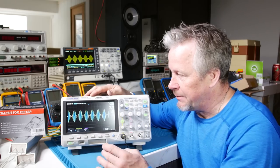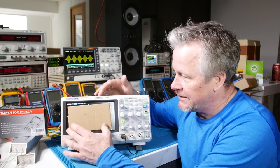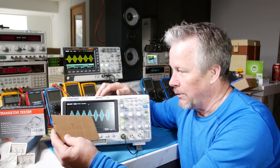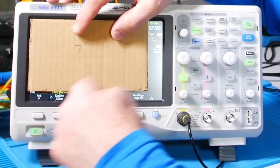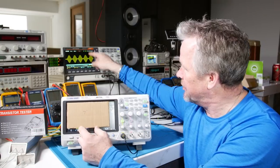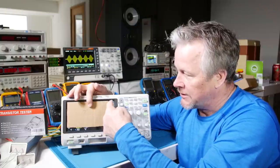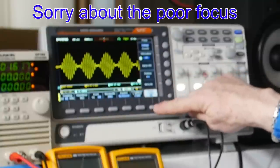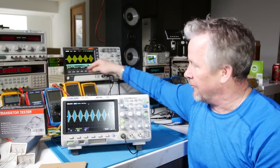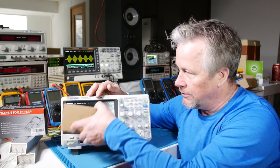About the display — these are 8-inch screens; a lot of scopes have 7-inch screens. Seven inches would seem large if you weren't comparing it to this. The thing that takes away your screen is the borders on each side. If I put a 7-inch area here, that's pretty much what I'd have left after the menu borders. So a GW Instek with a 7-inch screen would actually be as big as this 8-inch screen in terms of usable area, because on the GW Instek I can turn off the menus and reclaim my screen.